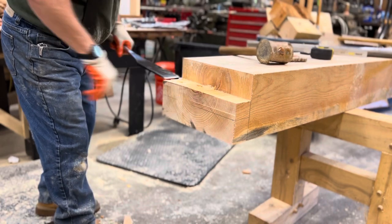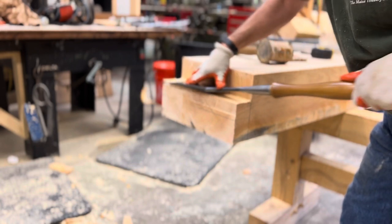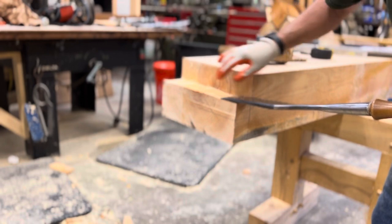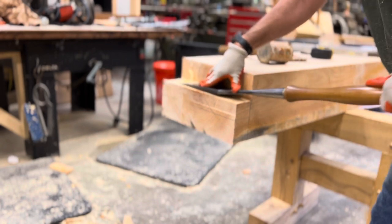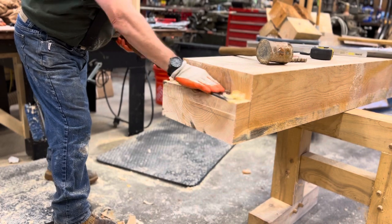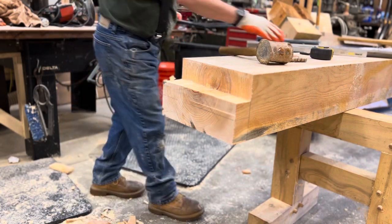I've got this relatively flat here. I'm going to come to this side — starting off with the flat side of my chisel, I'm going to work this material out. I'm getting real close to my line, and you can still see my kerf on the saw, which tells me I'm not deep enough yet with my chisel. But I've got this thing fairly flat. I can take a little more out. You have to have a sharp chisel — that's a given. I've got a Tormek sharpener for chisels and that works really well. Now it looks pretty close to what we're trying to get to.